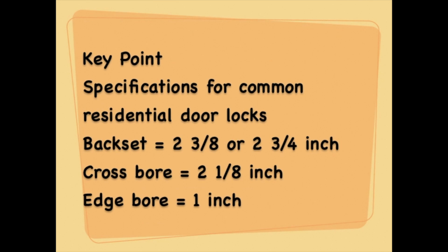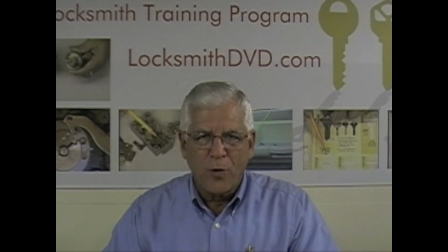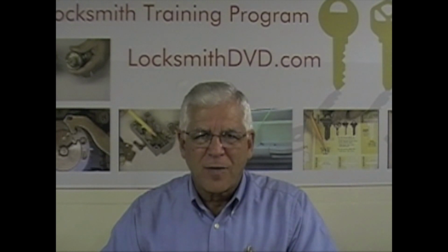The specifications for a common residential door lock are normally a back set of 2 3/8 or 2 3/4 of an inch. The most common is 2 3/8 inches. The cross bore is normally 2 1/8 inch, and the edge bore is normally 1 inch. This skill is pretty easy to practice if you can find an old door. Once you have found an old door, you can install a deadbolt up and down the door. In fact, you can use both edges of the door. Installing 1 or 2 practice locks will give you the confidence that you need to accept this kind of work and begin installing deadbolts for your customers.